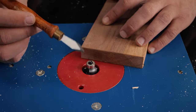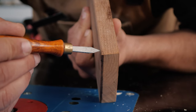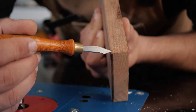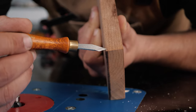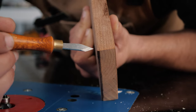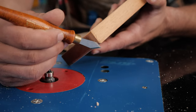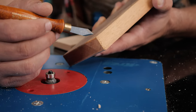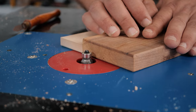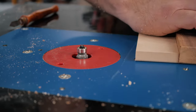So now you can see it fixed it most of the way, and you could probably dial that in with sandpaper, but there's still a little tear out there — and that sometimes is just unacceptable. That would drive me bonkers. Let me show you what happens when you use a backer board. You can see here — absolutely no tear out. The tear out you see on the edge was from when I cross cut it on the table saw when I was getting ready for this video, but no tear out whatsoever from the router. A backer board works really well, and you don't have to hold it super secure — just pretty close to right on the edge, run it along, and you're good to go.